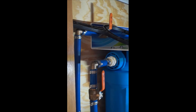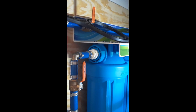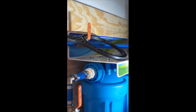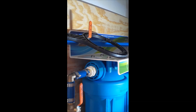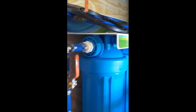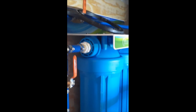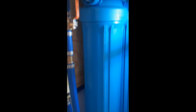Here it is installed. To plumb it in, I came in from the inlet valve right there, then created a bypass so that when I want to change the filters, I just throw two valves — the front valve and one in the back — then open a third valve. That allows water to flow through the house without cutting it off, in case somebody's in the shower, a kid's getting a drink, or someone's washing dishes.